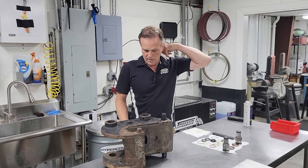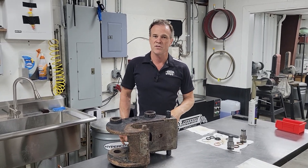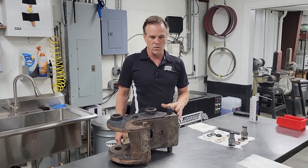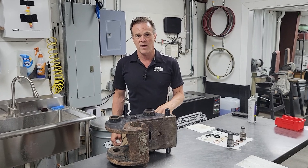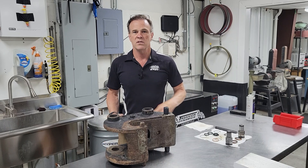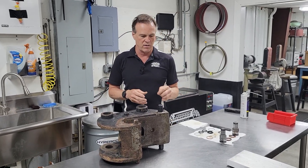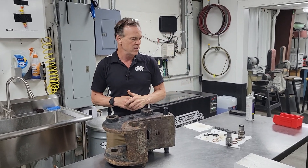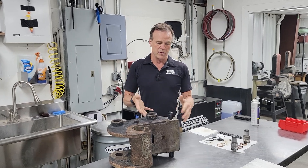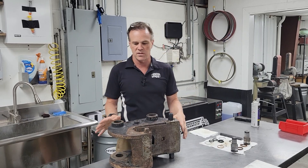At that point, I took — this had a lot of corrosion and stuff inside it, even though it's oil and all that. On mine, I happen to have a nice flex hone that happened to fit that bore. I just gave it a few quick passes to clean up inside it where O-rings and things have been sitting, and the piston had been in there — there's a little corrosion around the circlip groove. Clean that up nice, both sides. Then I spent quite a bit of time flushing through it to make sure there's no grit and debris anywhere left in this assembly.